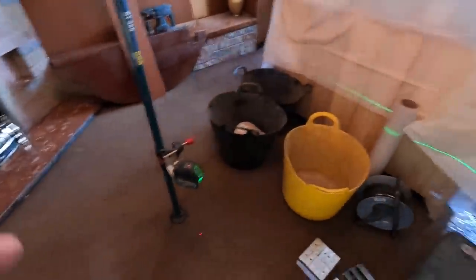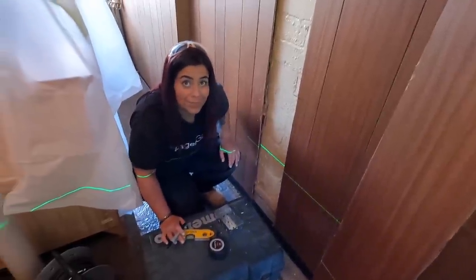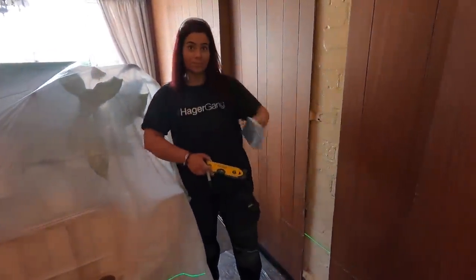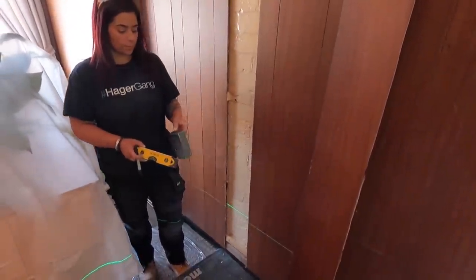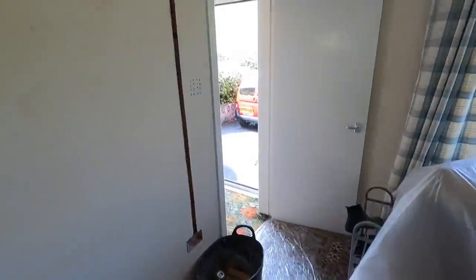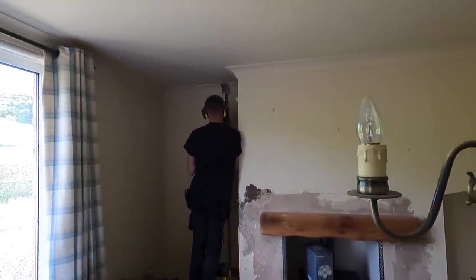Amy set the pole up with the laser on. We've set the laser up here because it's a bit more awkward with measurements off the floor. What size pattresses are you using? 35mm - and the purpose is we're sinking it in the wall just 15mm so it can be dabbed better. I forgot the light switch - we have a two-way here coming through for the lounge.